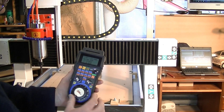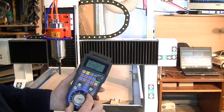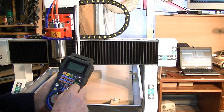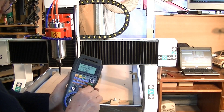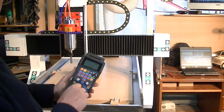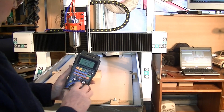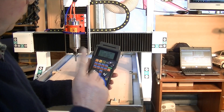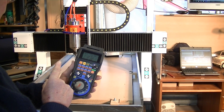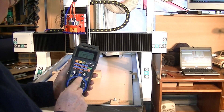You can move it with very high precision, or very quickly if you wish to. Just to give you an example, that's moving five thousandths of an inch at a time — it's coming up on millimetres here. Very, very good pendant. We're going to use the automatic tool setting to do the Z, but first we'll set the work offset manually, which is very easily done.